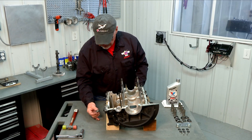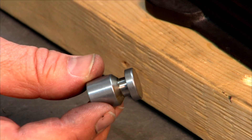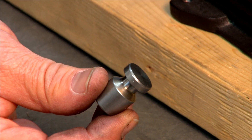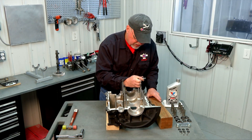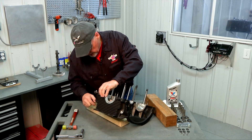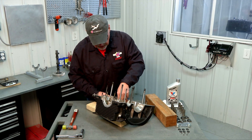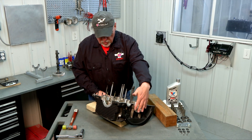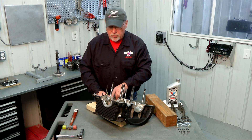We're going to start out here. This is our first oil control valve — you'll notice it has a little groove around the side and it looks a little bit like a mushroom on the top. This is the forward oil control valve, which is your high pressure relief valve that goes in the forward passage. Turn our engine towards the camera so you can see — the forward end is the prop hub end of the engine. The back end is the flywheel end, which on our application is the motor mount end or the back of the engine.